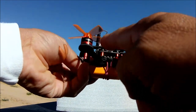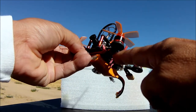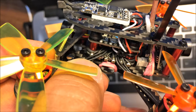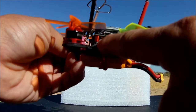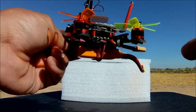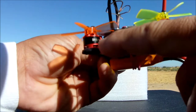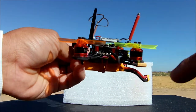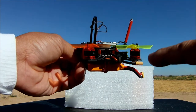There is the stack right on the bottom. What it looks like are these little rubber spacers in between that they have chosen to put even on the bottom — looks like there are two rubber spacers on the bottom. In between there is a rubber spacer between the standoff and on the top right below the screw. So they have done some kind of soft mounting to the whole stack. There is also a little plastic ring right underneath the motor as well, so they are trying to soft mount the motors too. Quadcopter manufacturers are starting to ship their products completely soft mounted — you don't have to do it yourself. That is really nice.